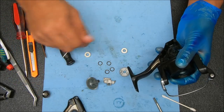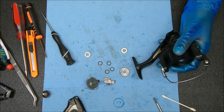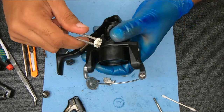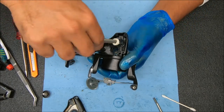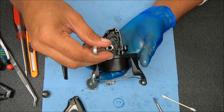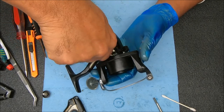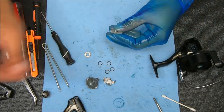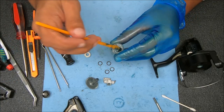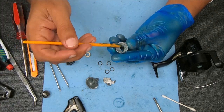Alright, now I'm going to go ahead and add the second bushing essentially, and just stick that inside right here. You see those two little prongs right there — there are two receiving holes inside the housing that it will go into. You can take something like this or tweezers, lightly push down as you rotate, and when you feel it drop in place, you're there. Now I'm going to grease all these — a light amount of grease, a decent amount around that post, and lightly grease the surface area of it.